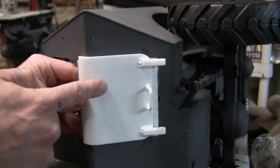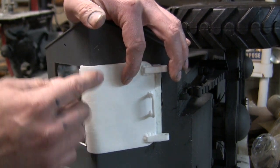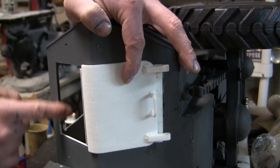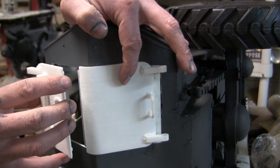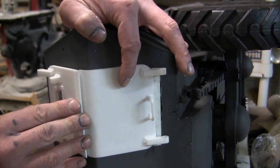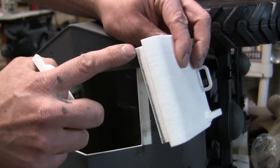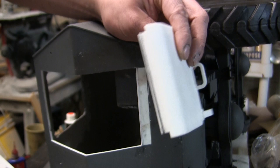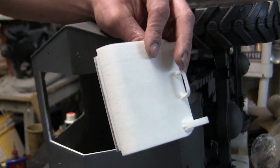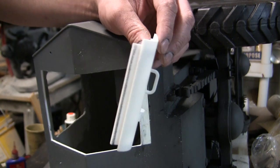The hatch is where it needs to be in this format. From here, I can take the top portion of the hatch and mate it properly to see exactly how much plastic needs to be added. On top of that, I'm also going to trim this amount of material from the 3D printed component, because as I stated, it's slightly too long on this pre-production sample. For this one I'll trim it, then make the appropriate adjustments in the CAD software so that the production units won't require this step.